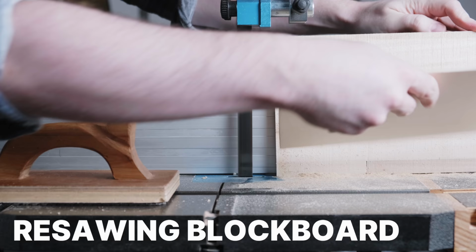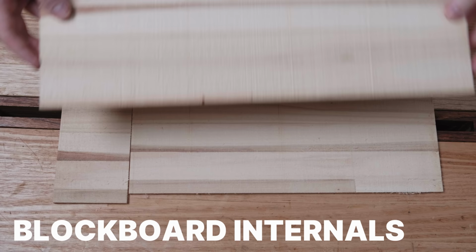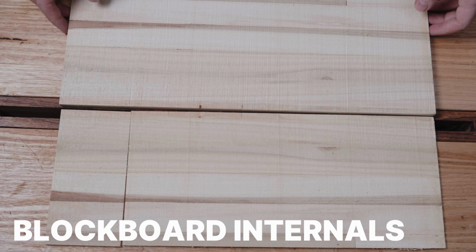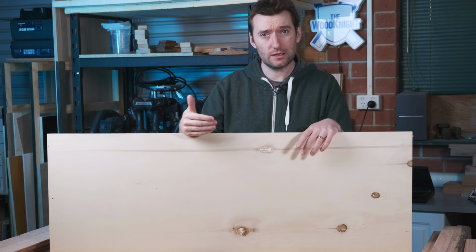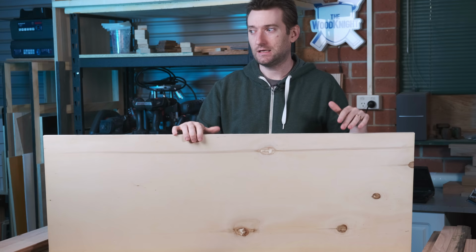The advantage of this is it's considerably lighter than plywood. Plywood, a lot of its weight comes from the glue. Because this has got more solid stuff in it, it ends up having fewer glue lines, there's less weight. It is designed for veneering rather than appearance grade, so having it that little bit lighter is actually quite beneficial when you might be doing a large tabletop.